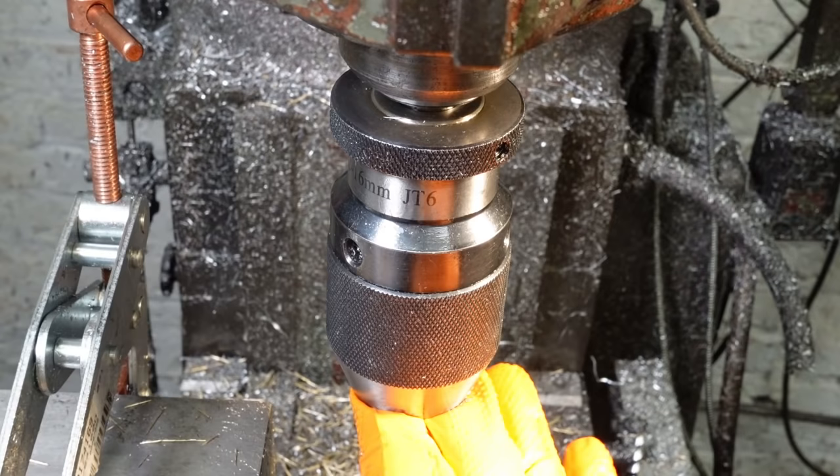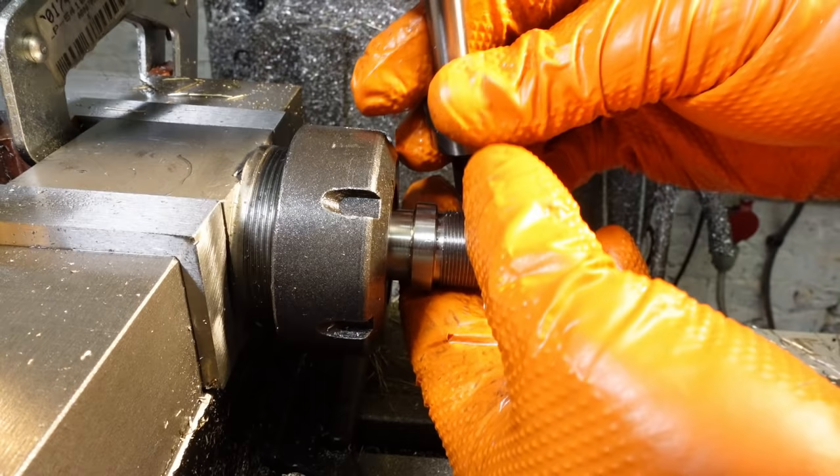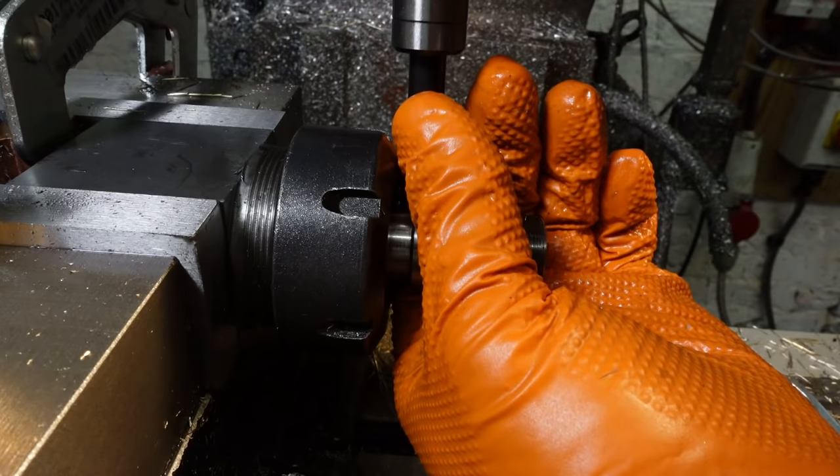I'm using a dog point grub screw to prevent the bit holder from rotating. It'll run in a slot that I must remember to mill. The hole for the grub screw is in the 25mm diameter raised collar, so I need to drill and tap a hole there. Yes, I know I've got a nice shiny Haimer, but this simple edge finder is actually good enough.